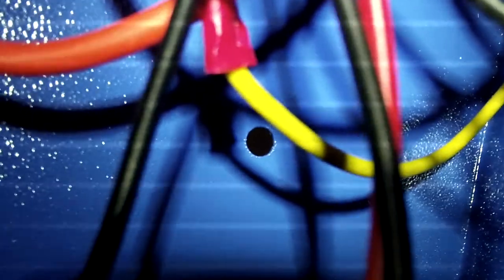Don't know, can you see? You can see the flashlight flashing. But there's the hole for the grounding, and there is no grounding, and it's all paint. So the case is not grounded at all. So this would be pretty scary to use right out of the box, and that's why I wanted to go through and do this kind of stuff.